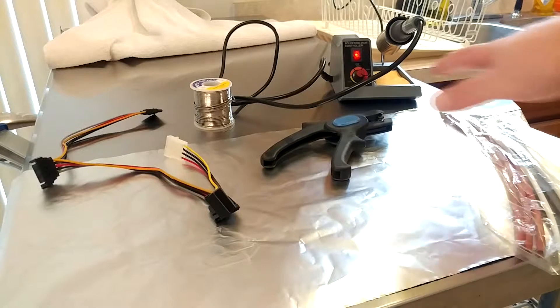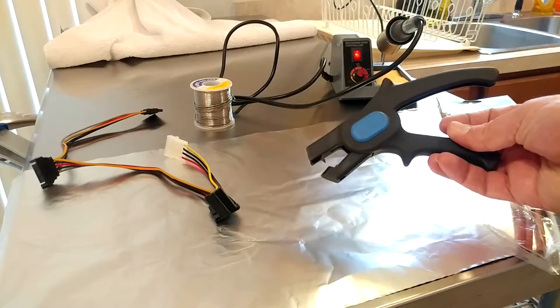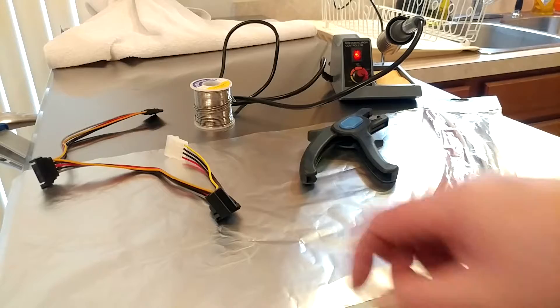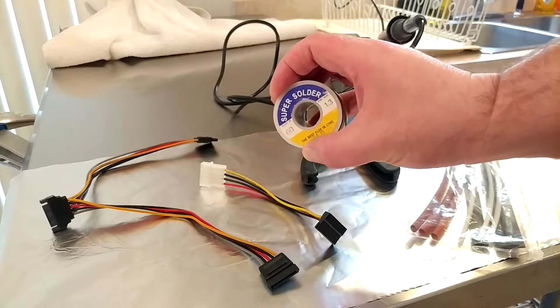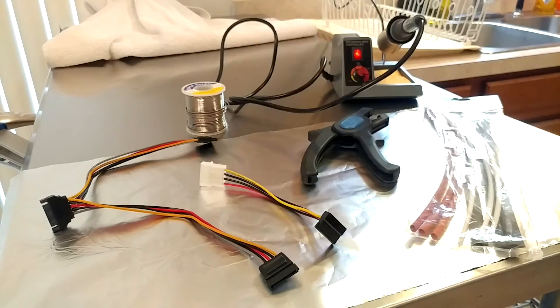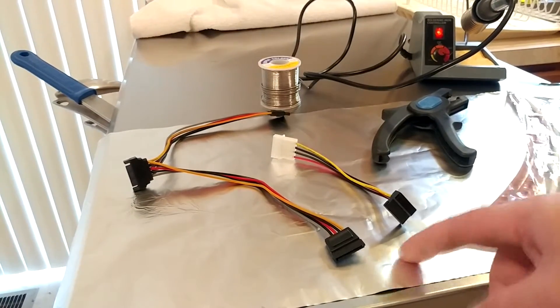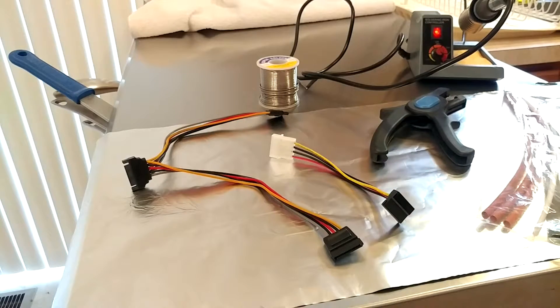Here's pretty much everything we're going to need. I've got my super cheap soldering station from Parts Express — I think it's a Stahl brand — a set of wire stripper cutters, some shrink tube from Harbor Freight, our two cable ends, and a spool of solder. This happens to be one pound of 1.3mm solder. If you're new to soldering, look for flux core wire — don't get the lead-free if you can help it. We're doing this on a stainless steel table with aluminum foil down so dropped solder doesn't stick.